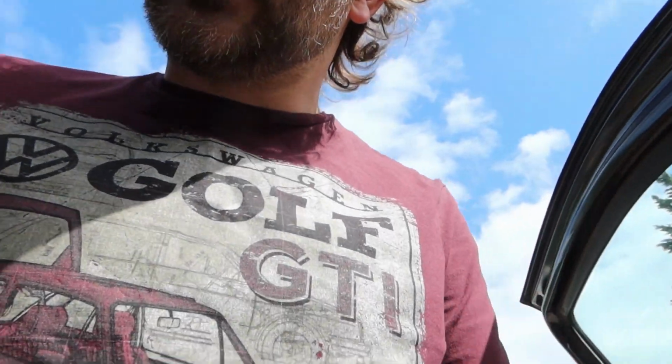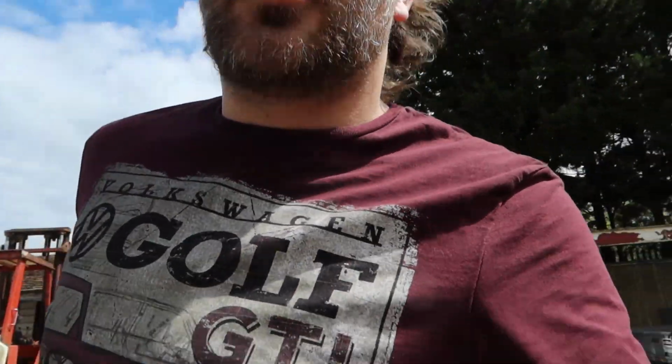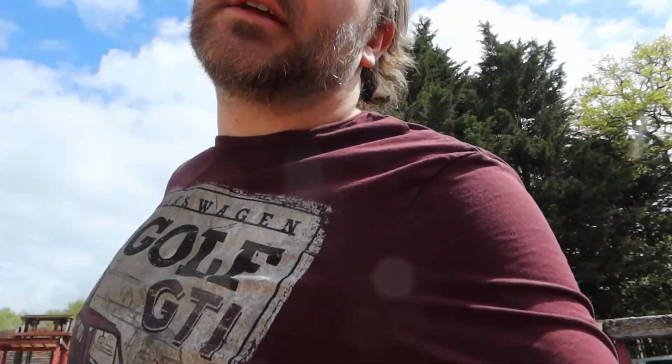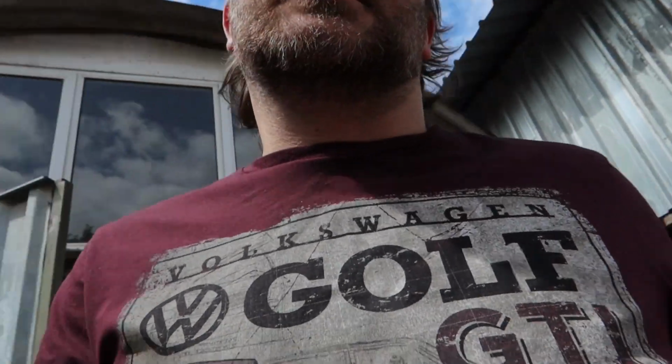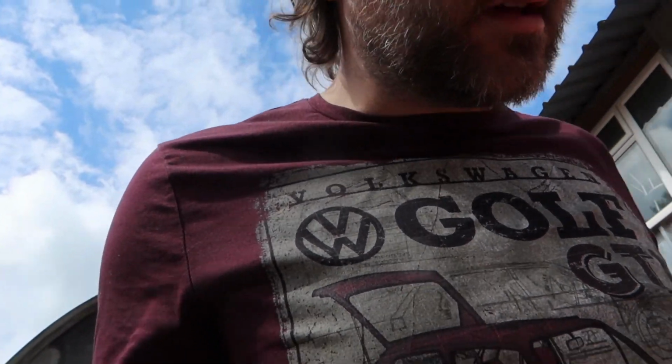Next day, he's back. Come bearing gifts. New tyres, the smallest tyres I could possibly find. 145 60/13s. Currently has 145 80/13s on. I've also got some smaller tyres for the rear. I mean, they're not smaller, they're just not as balloony. I've got 155 65/13s for the rear, when previously it had 145 80.